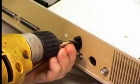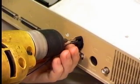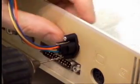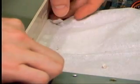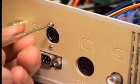I double check that the hole for the composite video fits and then continue to drill out the larger hole for the S-video jack. As I don't have the exact size of bit, I have to do the final cut with a knife. Once I'm sure it fits, I line up the S-video jack on the outside of the case to drill the screw holes — first I do one and screw it into place, then I do the next. This ensures that the holes will line up. Once done, I remove the tissue and install both ports, tightening them down.